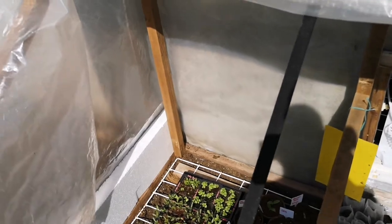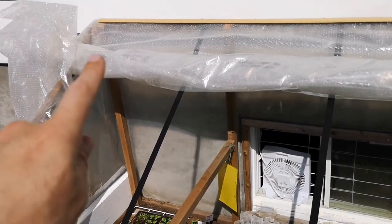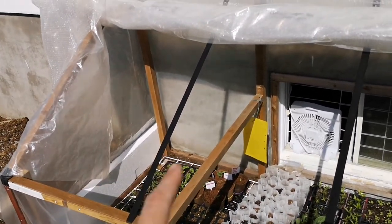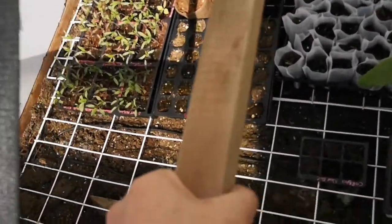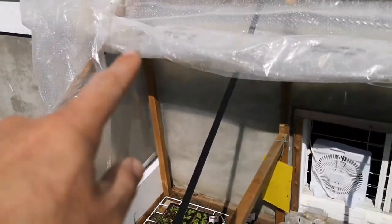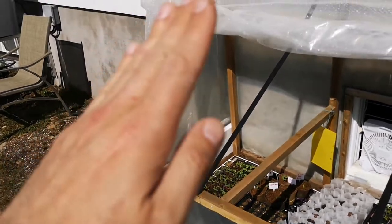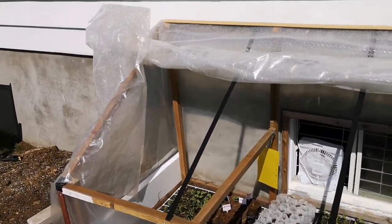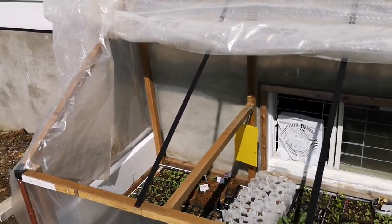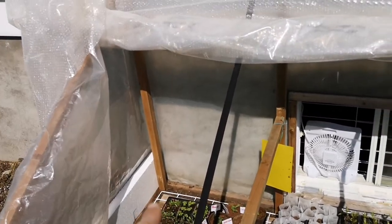I just screw it from the side at the base. Then going up the back side I kept it four feet high — simple for the cuts. I used two-by-twos from there; the only two-by-fours were for the base. The front I kept at two feet high, in order to have a 45-degree pitch that lets the snow fall down. Even without a really solid roof I never had a problem with snow buildup because the pitch is good.